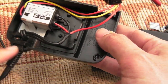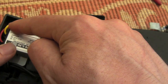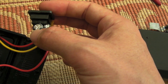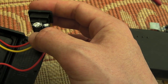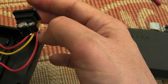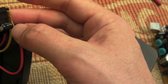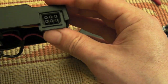So what I've got here is this 12 volt power supply powering it. I've got 12 volts coming in, 12 volts goes into the DC to DC converter here to drop down to the yellow wire, which is 3.3, and then I've also split the 12 volts that's coming in and taken it straight to the connector, and then I've just got a cap. The larger cap is on the 3.3 volt rail because that's the one used for all the logic and stuff. I think it's only 470. It could perhaps do with a 1000 or 2200, but I've tested it and it works really well. It's reliable, so I think that's okay. And on the 12 volt line, it only uses a few hundred milliamps at most, even though it's rated up to 0.8 of an amp. So I've just got a 220 microfarad cap on the 12 volt rail. So it really is just a case of put the lid on and this is done.